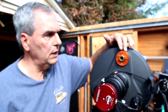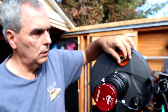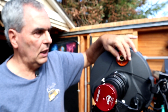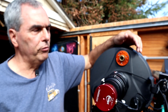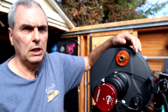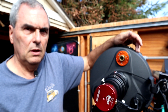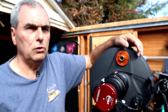I've installed both the original plate and the new adapter plate with the longer screws, tightened them down, and got this as centered as I can. The mirror focuses easily — no problem rotating that shaft — and there is no wobble in the shaft, just like it was with the original plate. I think that will take out some part of the mirror flop that happens as you're imaging across the sky over a long period of time. Dave has seen a noticeable improvement in the amount of image drift associated with that extra mirror flop. You can't eliminate all the mirror flop inherent to these SCT designs where Celestron focuses by moving the primary mirror, but you should see a noticeable improvement.